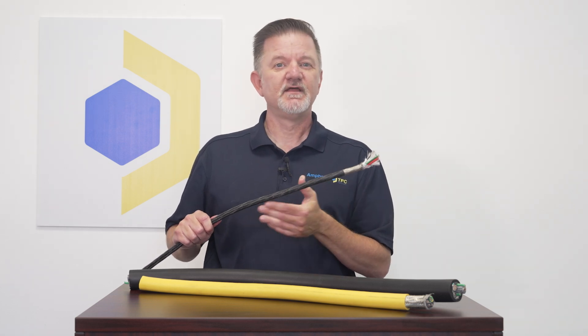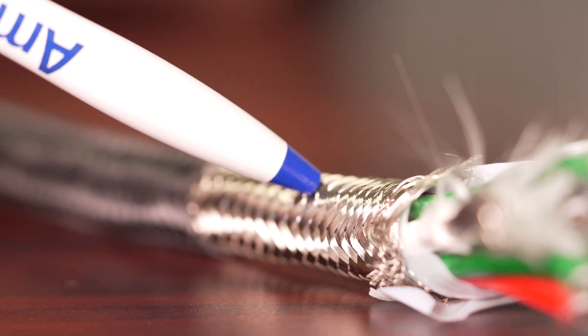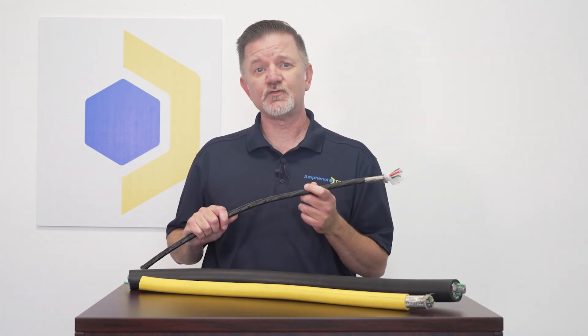The newest and most unique VFD cable in ATPC's lineup is our Thermotrex high-temp VFD cable. As the Thermotrex name implies, this is our highest temperature rated VFD cable offering. Unlike the tinned copper used elsewhere, Thermotrex features nickel-plated copper conductors, silicone rubber and fiberglass yarn insulation, and a nickel-plated copper braid shield, which allow this cable to be rated for 200°C maximum conductor temperature — more than double the temperature rating of most other VFD cables on the market. The unique fiberglass outer braided jacket is coated with a finishing compound to help prevent snagging and fraying, contributing to the high heat resistance. This product is also rated to 600 volts and features three symmetrical grounds to electrically balance the cable.